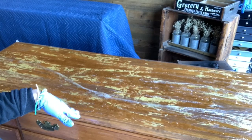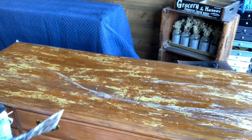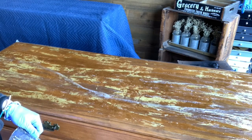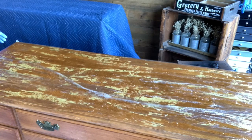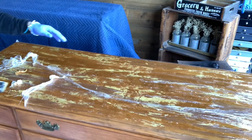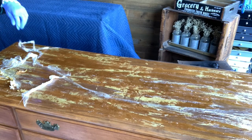It has been about four hours. I'm going to go ahead and remove this and start to give it a go. I have a plastic scraper I can't find, so I'm going to use this metal one very gently so I don't gouge it. As long as I don't try to really work the stripper off too aggressively, it should be fine. The key is to work quickly and just go to town. Part of what you're seeing come off is the saran wrap as well as the top coat. It definitely worked to remove a lot of that lacquery finish, and that was my goal.